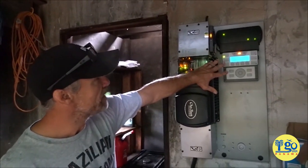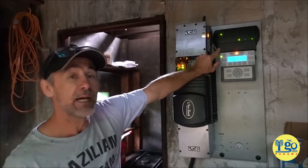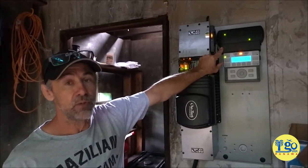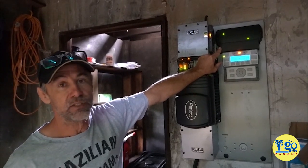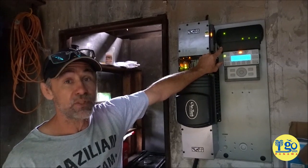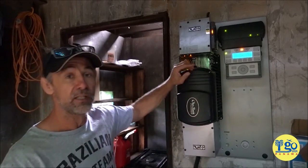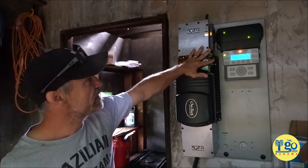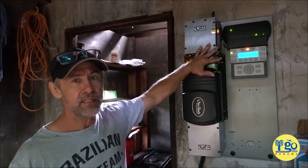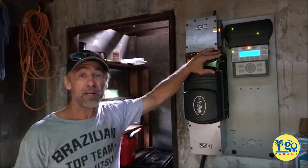The Outback system is really good because it monitors everything. If you have Wi-Fi you can download an app and it will send everything to your phone — you can track your battery levels, track error messages, and have an up-to-date percentage reading. You can even set warnings if you want it to alert at a certain level. Our technician has set it at 60%, so when the battery levels hit 60% the whole system will shut down to save the batteries, since gel cell batteries are quite expensive.